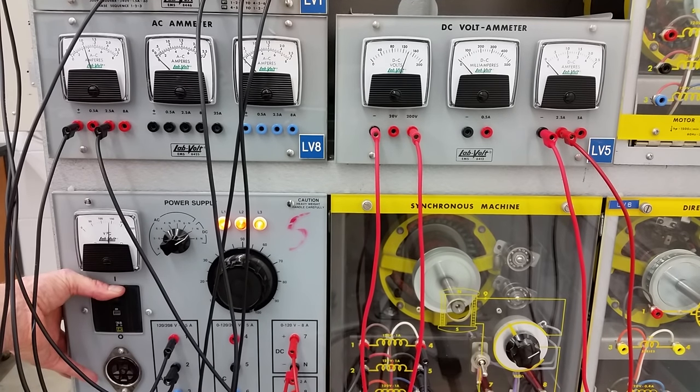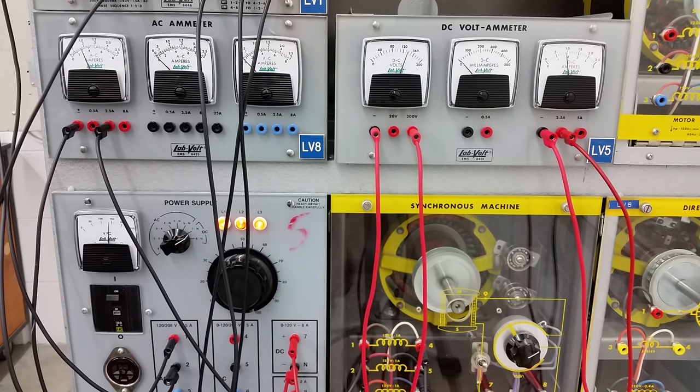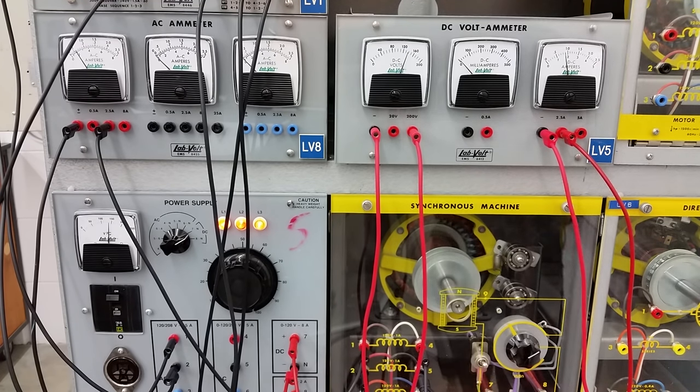The last point: with a synchronous motor, regardless of the physical load on the motor, once it is locked into the synchronous magnetic field it will maintain the same speed up to rated load. From zero load all the way to full load it stays locked in. The beauty of the synchronous machine is that it maintains its speed — 3600 RPM or 1800 RPM — because of the DC applied to the rotor. Hopefully that clears up synchronous motors. Thanks for watching.